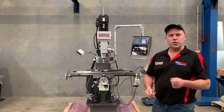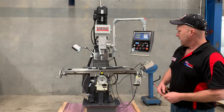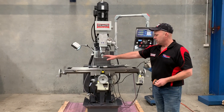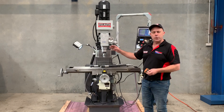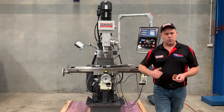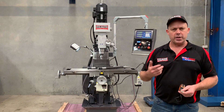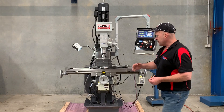It's a gear head, 240V, ISO 40 universal millmachine. The table itself runs 1200x240, and it's got an ISO 40 vertical spindle and an ISO 40 horizontal spindle. ISO 40 is traditionally the heavy duty industrial size used across industries.